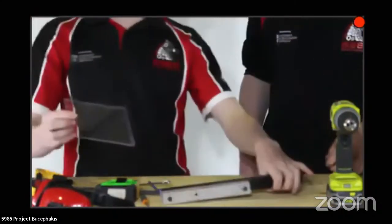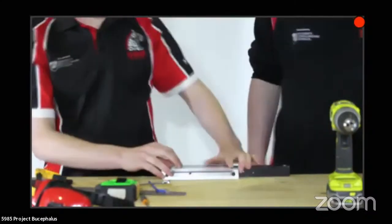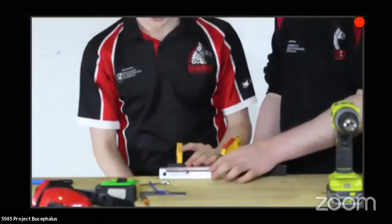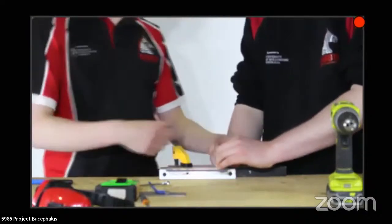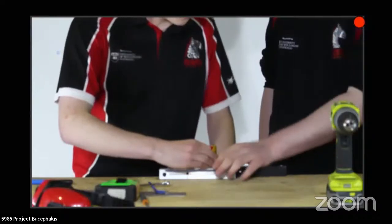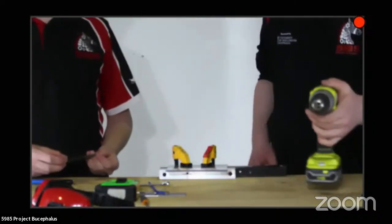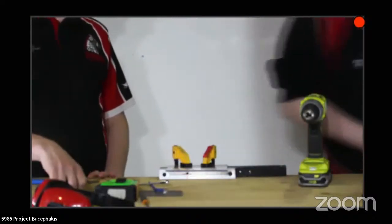and we're going to rivet it onto the top here. Once again, we're going to clamp it in position and drill through both pieces of material at the same time, because that gives us an easier time of actually having the holes line up properly. So you can use a center punch on polycarbonate if you want to, and in some cases you will need to.